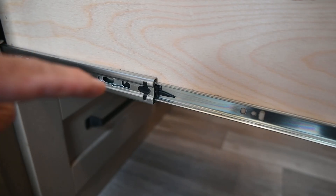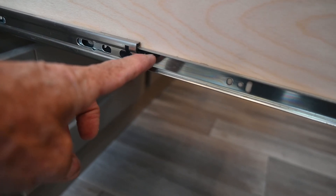To get through the roof, first clean out your closet so that you don't end up with dust or insulation all over the stuff inside. You're going to want to drill up through the roof, not down through the roof — so start in the closet and drill up. Measure, measure, measure, and then double check to make sure that you're in the right spot.